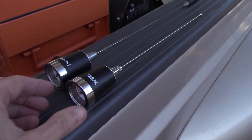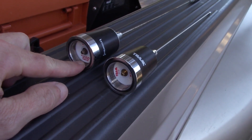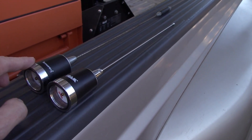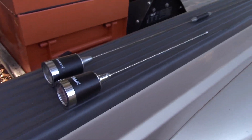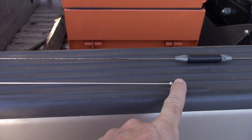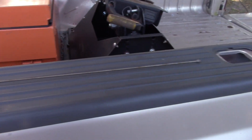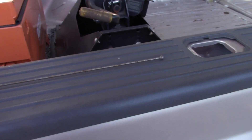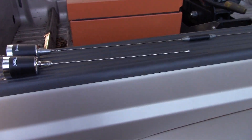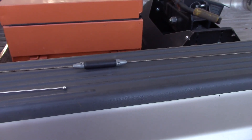Here I have it lined up with the Browning BR450, which I've been using for a few months. It's a 5/8 over 5/8 collinear antenna and I have it tuned for GMRS - it's also okay at the higher end of the ham 70 centimeter band. Lengthwise, this Tram is about 13 and three-quarters inches uncut, compared to about 34 inches for the whip on the collinear. It's less than half the height of it, and less likely to hit stuff, which I like.